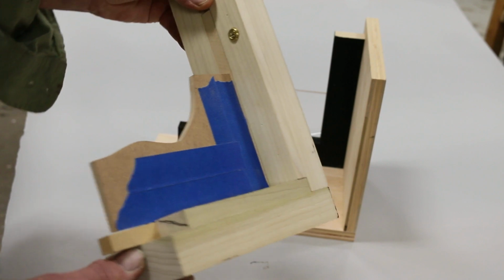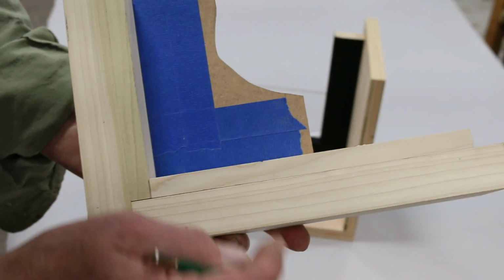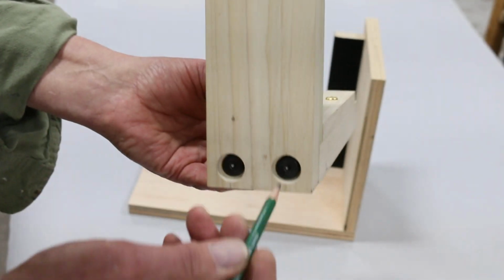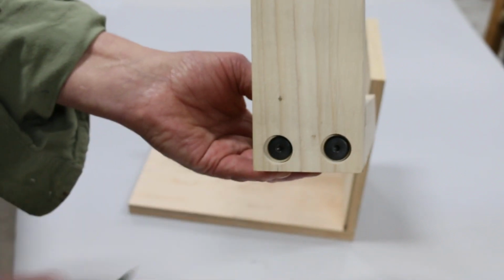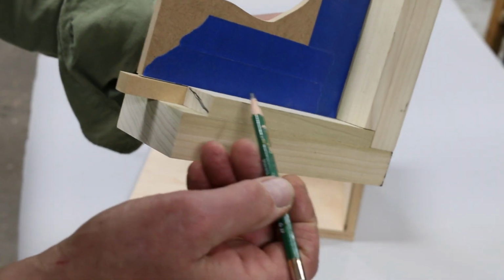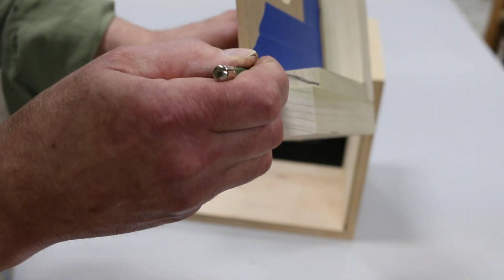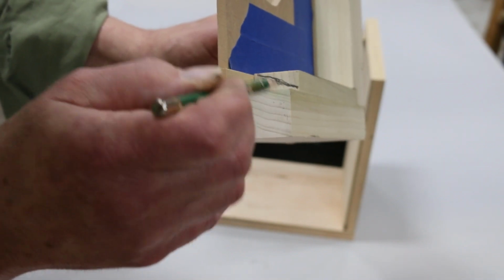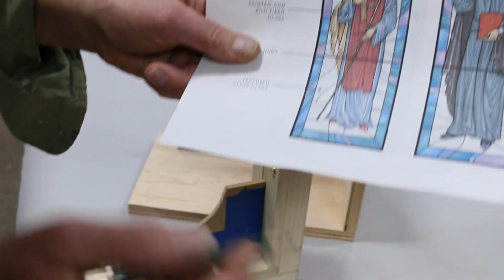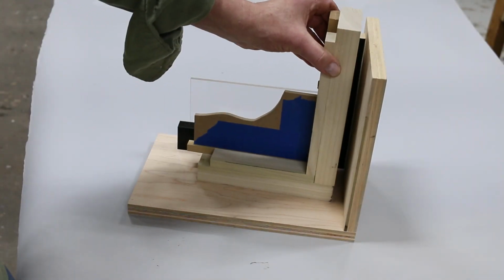The other thing that impacted it significantly, and I'm showing this cross section being 1 5/8, that's the dimension of the aluminum extrusion. This dimension is about 3 inches. It felt comfortable, gives me plenty of room for 2 good, solid, secure screw connections. But at this dimension, this corner has a fairly significant impact on the sight lines. So I'm wondering if we might want to consider a shape on this bottom rail, beveling it or canting it down, and that opens up clearer sight lines to that bottom blue glass border.